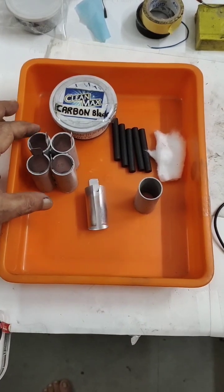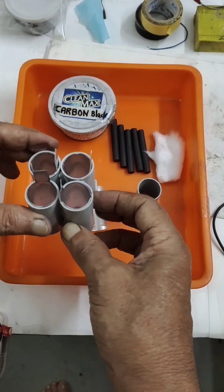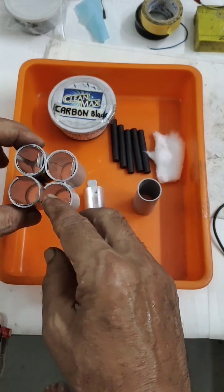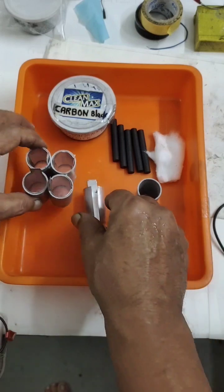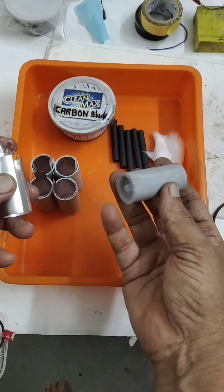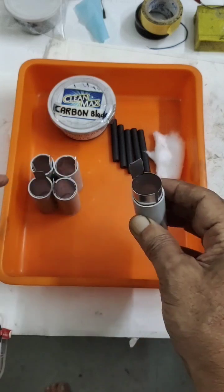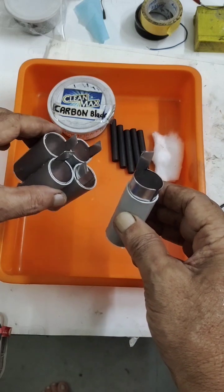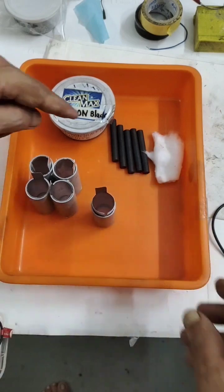The major items required are PVC pipe cuts. I joined all this as four-in-one cell, so inside I have inserted aluminum in a round shape as the negative. This is how I made a single cell. I will insert it like this — as shown here. Then I connect them in series, and for the positive I have taken carbon electrodes.